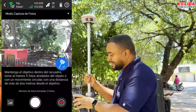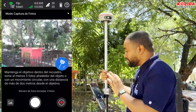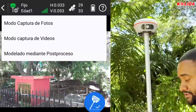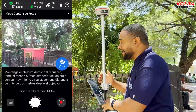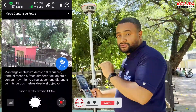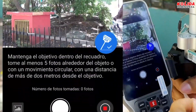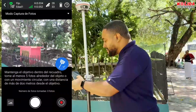I'm going to go back to photogrammetry. With all the conditions given, I have to aim at my target — that spot right there. I want to take that roof. Because of the height I have, I want the three points of the roof and not the entrance. I have three ways to do it: by photography, by video, or by post-processing. I'm going to take it by photography. I go to photography and I have to take at least five pictures. Always with the lens in the center of the frame. I have to move in one direction, going around the object. Keep the target inside the frame, with a distance of more than two meters from the target. I'm about four meters from the target, so I'm good. I'm in the center and I'm going to start taking pictures.